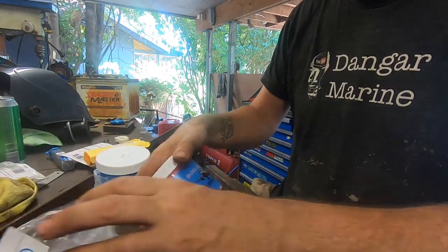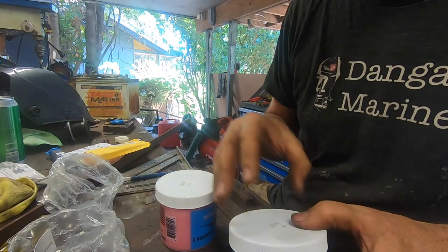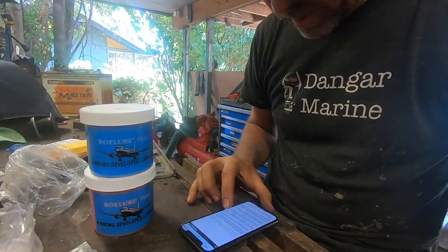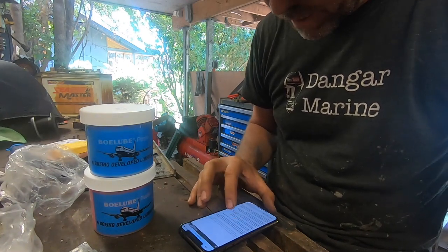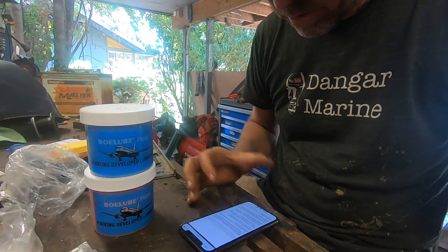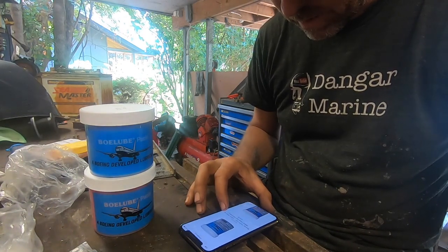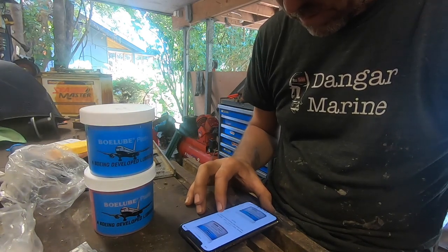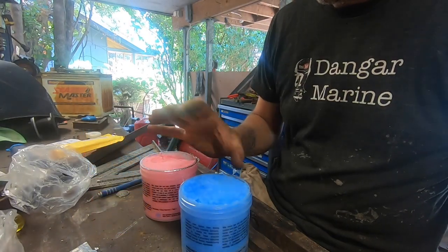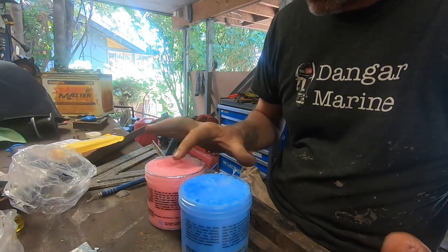Because we're doing some drilling right now, we also have some Boeing-developed lubricant - Pace Boe-Lube - which apparently is the bee's knees. Pace are highly efficient MQL lubricants designed for the standards required by the aerospace and similar technology industries. Non-hazardous, environmentally safer, worker friendly. There's soft, medium and hard - not quite sure what hard means in terms of lubricants, could simply be the consistency of the paste. I presume the hard is just physically harder than the medium.